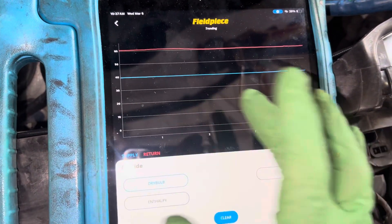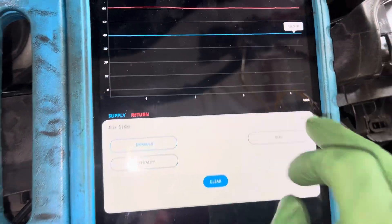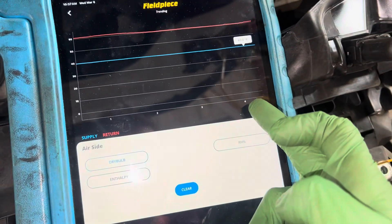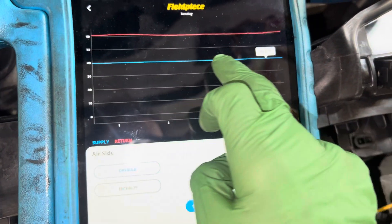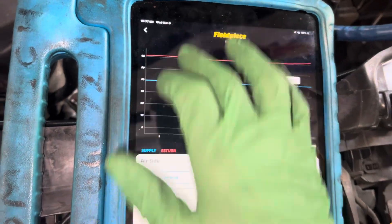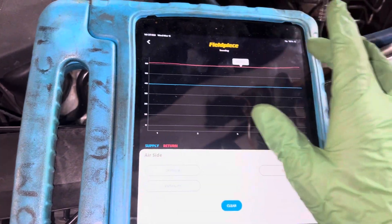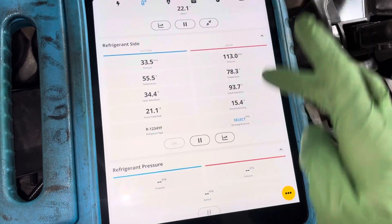Our pressure and temperature has been staying right around 39 degrees. You can see minute one right here, minute four. I didn't turn this on until it was already running about five or six minutes, so we're already into minute 12 or more. We're dead flat and steady on our temperature — no off and on, no cutting in and out, no up and down, just smooth. Our outdoor temperature is right around 50-some degrees out here, with a little roll of engine heat adding to that reading.